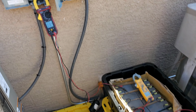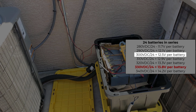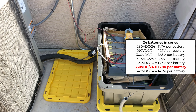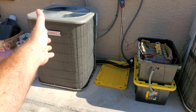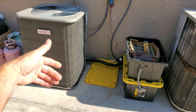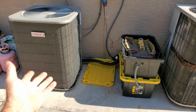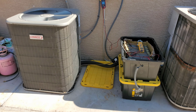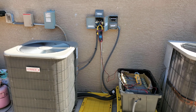So at this point, it's not really putting much into the batteries, but for a couple hours it was. With the amount of solar panels I have right now, and how this runs constantly, it just goes down to first stage until it gets into the night. During the day when the sun's up, this thing's running at least first stage, which is about 2 tons from upstairs. And then it's 3 tons when it goes to 60 Hertz. That's what this unit is, a 3-ton unit.